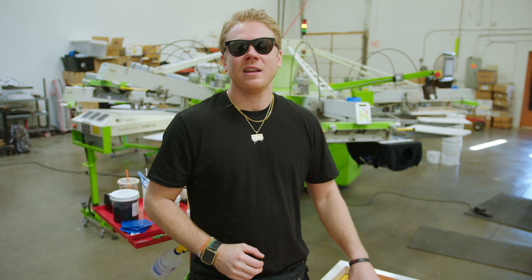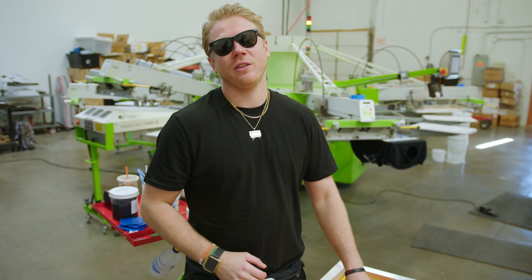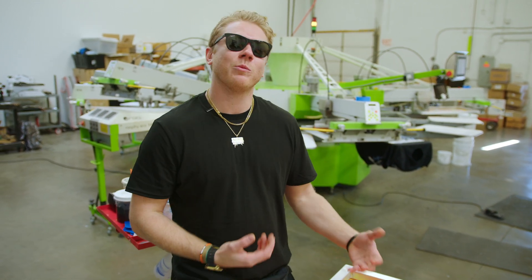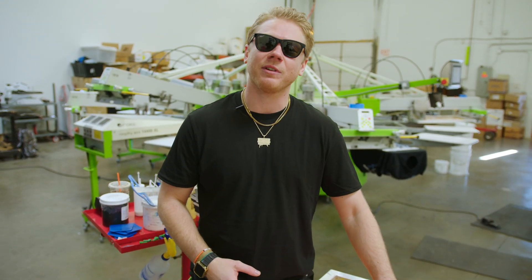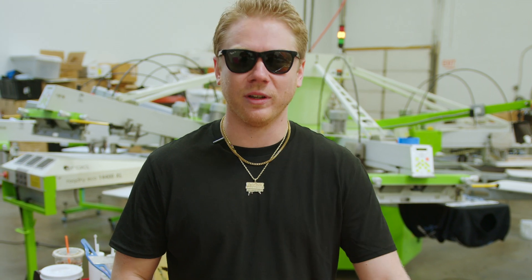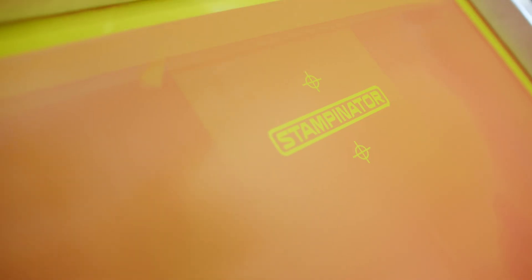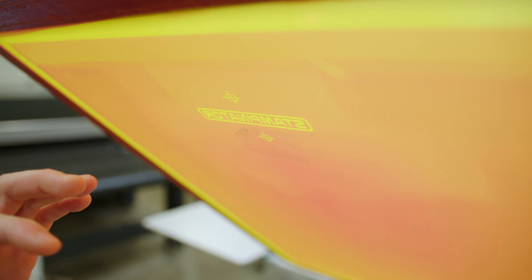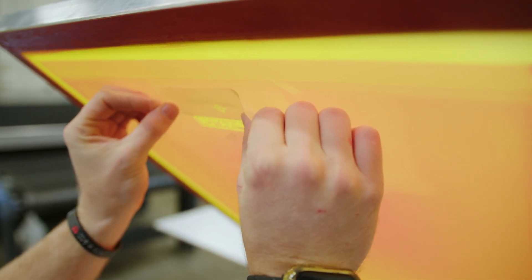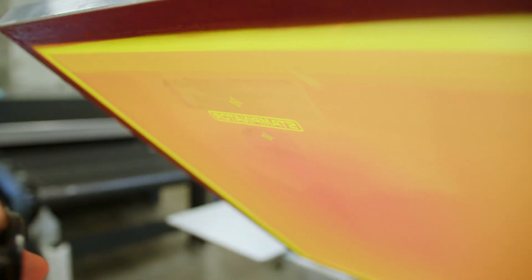Now when you're doing smaller prints like this, you always have the ability where you don't necessarily have to tape the screen. You just have to be more conscious of how much ink you're putting in the screen and how you're controlling it. We're not going to actually tape this screen up — we're just going to make sure we're controlling where our ink goes and where it flows. We're going to tape off our Regimark. When it comes to any type of taping in the screen printing industry, it's always nice to do a little dog ear where you're simply folding the corner of the tape. What you're doing is setting yourself and your team up to make it very easy for them to simply just peel that piece of tape right off the screen when it comes to cleaning.